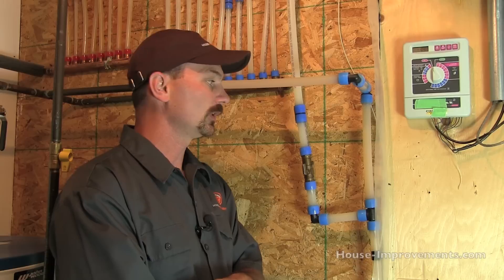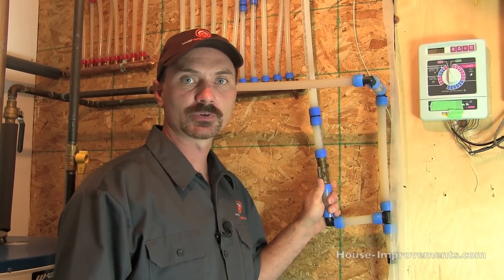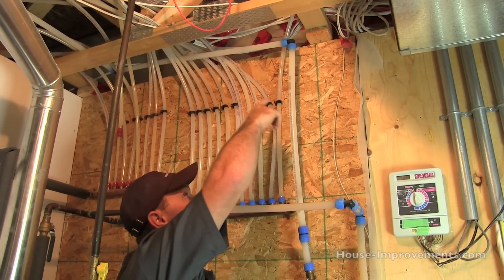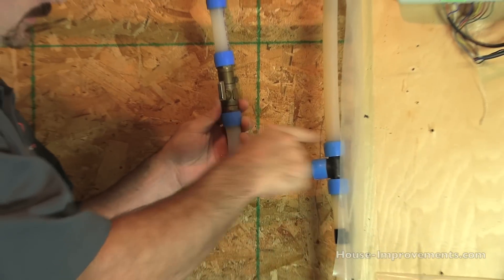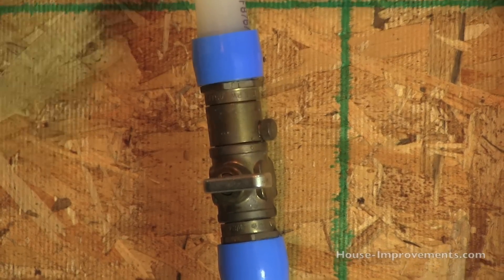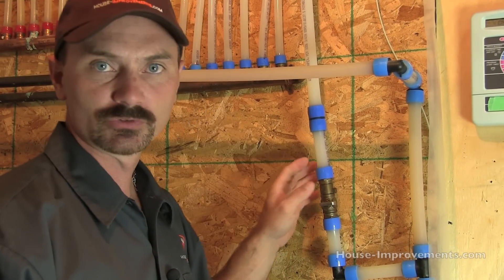The next thing we want to do is drain the actual water from the outside, wherever it goes to the outside and enters your valve system to the interior of the house, so that you don't end up freezing that water line. In this home, the line comes from across the other side of the house and comes down to here. They've got a valve here to turn off the water supply. We're going to turn it off, and it's got this little drain on the side. When I open this drain, all the water from this point all the way back to where it goes out the house, to the valve out there, will drain out to this hole.